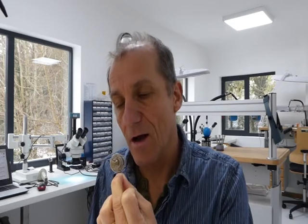The customer complains that the watch isn't keeping good time anymore and that the movement is running erratically — sometimes it stops. So we have to find out what's wrong with it. A first look at the movement: I look at the balance and I see that it doesn't swing as far as it should, so it probably has a low amplitude — meaning the angle that the balance goes through. We have a machine to test this, it's called a time grapher, and I will quickly put the movement on the time grapher so we can see how it performs.